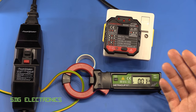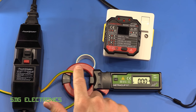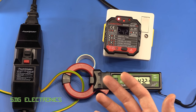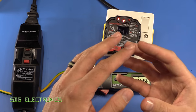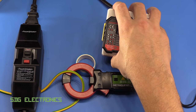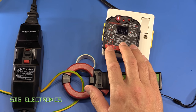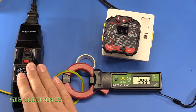With a milliamp clamp meter connected to the earth conductor, this device is actually conducting 4.4 milliamps down the earth conductor, which would be a really quite noticeable shock. If you were holding the plug on small contact areas you'd probably not be unable to let go, but it would certainly be an experience you wouldn't forget. That is one downside, something to bear in mind when testing metal sockets.